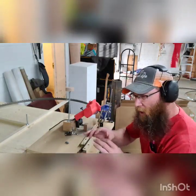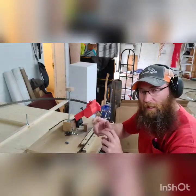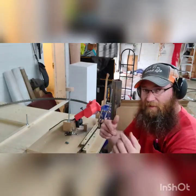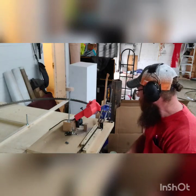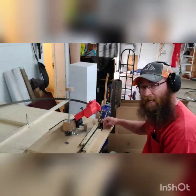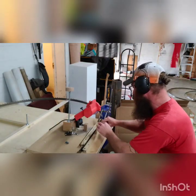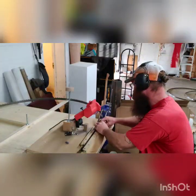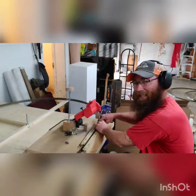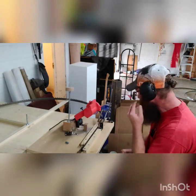I have another piece of this angle right here secured down to the board, and I scavenged on the chainsaw sharpener. There was a turn screw that was used to set the position of the tooth when you go to grind it. I actually scavenged that out of it, and I've used it here with a flange nut on the end and a second nut just to lock it into place. And I'm twisting it right now and screwing up my setup. So maybe I shouldn't do that. I didn't jam these back into place. I may have to tweak that in a minute.